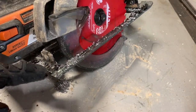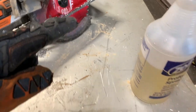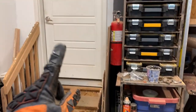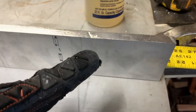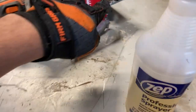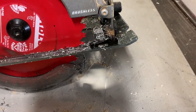This does make just an absolute pile of hot spicy chips all over the floor and everywhere else. So you're better off taking this over to your neighbor's yard or something like that if you can. But if you're like me and your entrance into your kitchen is right there, you have to have the broom and everything real close and handy. This is just WD-40 — putting on a little bit of that to keep the blade from galling up with chips.